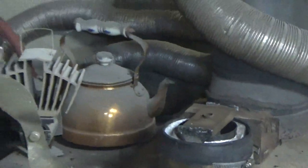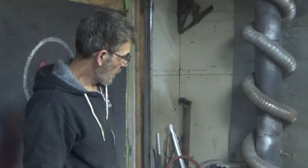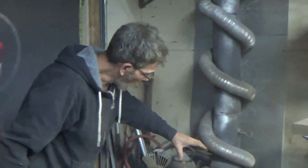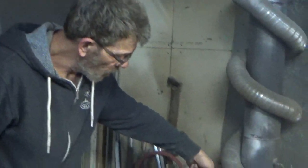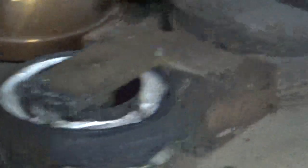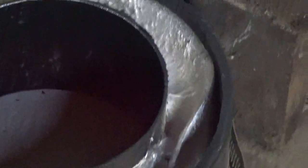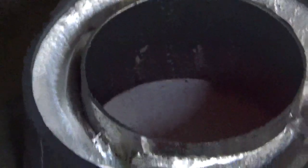Well, that was a bust. I know why it was a bust. I have an outer cylinder, four pieces, it's clamped. I have an inner cylinder. Basically what I'm trying to make is aluminum tubing to create a different style alloy rim. We didn't fill the mold, so it dropped out. You can see where it escaped — it got underneath. That kind of sucks, but you got to see the attempt.